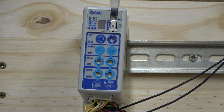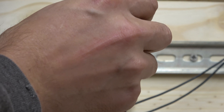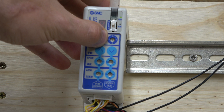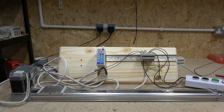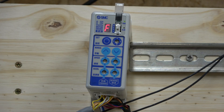To teach the stroke, flip the switch into manual mode - you can see it's flashing red. Then turn the position dial all the way to position 15, or position F. Once you're in position F, just hold the SET button for about three seconds. As you can see, the drive is now learning what it's working with - it learns one end, then the other. Once it's done, the F stops flashing and the alarm should be gone. That's the first step when you get it out of the box.